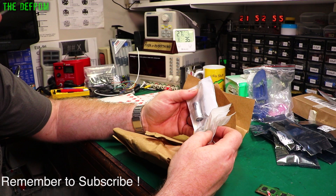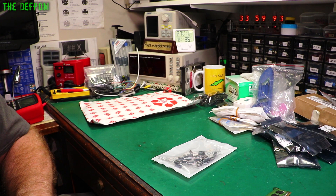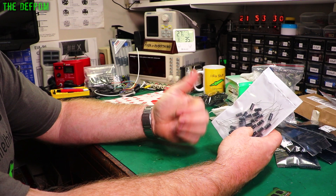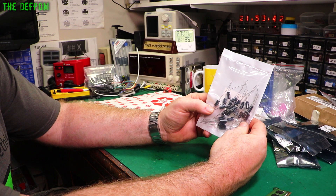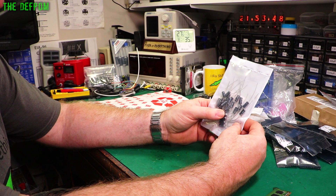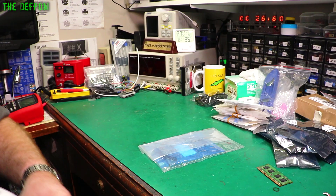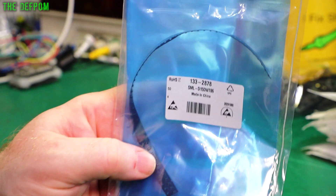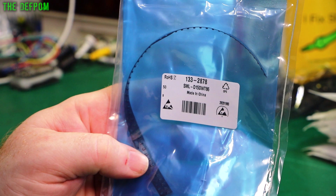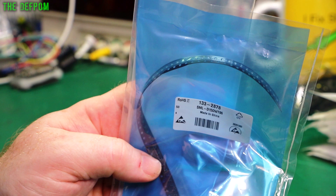Some more caps — doing all these together because it's just quicker. 33 microfarad, 25 volt. These are the ones I was waiting for — the 33s. Because I had 47s which were oversized, and 10s which I was getting low on. These 33s are for the Datrons — on the analogue board the Datron uses these capacitors in a bootstrap circuit. I was really low on these so I grabbed a bunch. These are about $4 each. Also these are LEDs — SMLD15DWT86, 0603 sized, orange. These are used for the enunciators on the Datron display — kilo ohms, mega ohms, volts, plus and minus symbols. I thought I'd get some more because I'm going to need them.